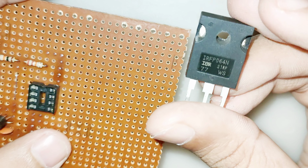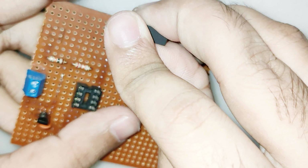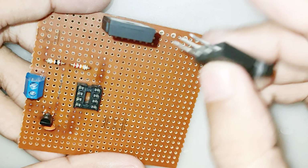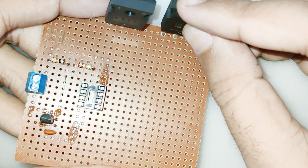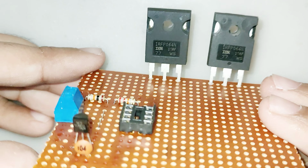You need a fixed 12 volts power supply for the MOSFET and LM358, and the input test voltage can be 3 volts to 30 volts and 100 watts maximum. I got 25 watts maximum without a heatsink. You must use a heatsink to reach a higher current value.